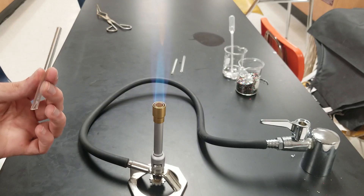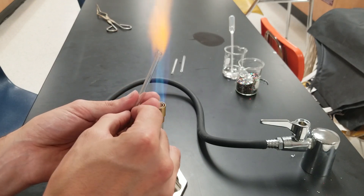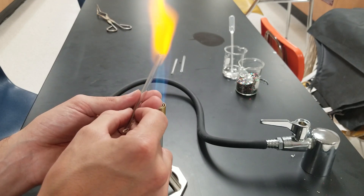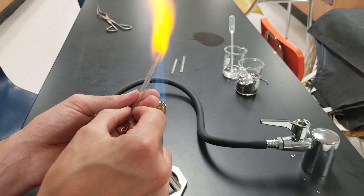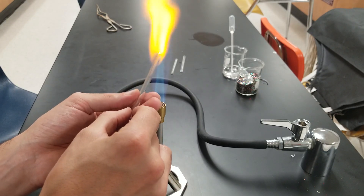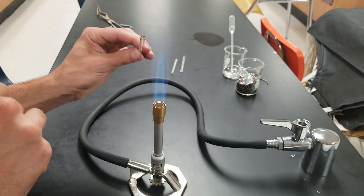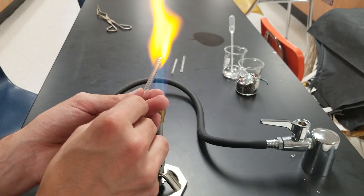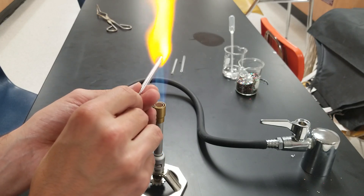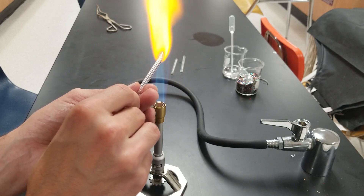Now suppose I want to take that a little further — what if I want to melt it closed? I put it back in the flame and continue. It's the same process as fire polishing; the only difference is if you want to melt it all the way closed, you just keep going a little bit longer. I keep the rotation going. I can see it through the flame — occasionally I'll pull it out to check on the progress, but for the most part I want to keep it in the flame. You can see that bright yellow flame — this glass is sodium based, so the sodium atoms are releasing that yellow color to the flame.